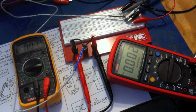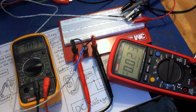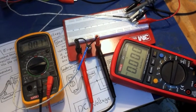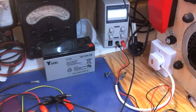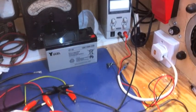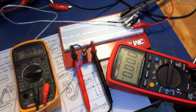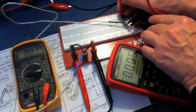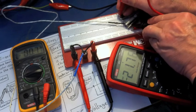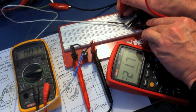Now that it has reached the same 0.7 temperature value, what does the DC power supply voltage value show us? The power supply readout shows this. But to confirm that value, I'm going to use a multimeter connecting it directly across the resistor. So here we see at the same resistor temperature value of 0.7 — i.e. the same power usage — the voltage across the resistor is approximately 21.7 volts DC. So now we have all the data; the experiment is finished.